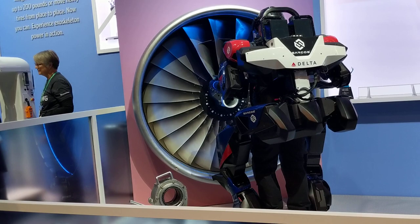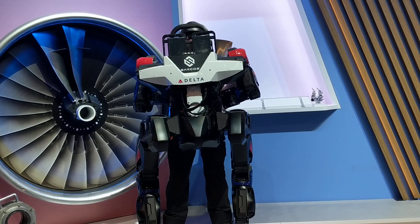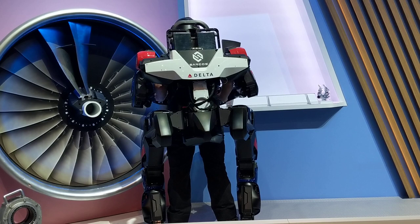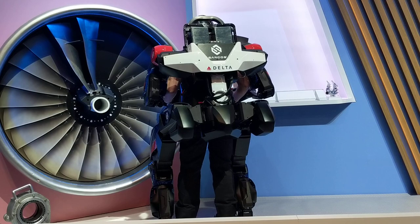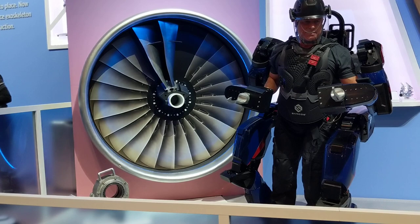Lock my arms again. I've removed the nut. Now I'm going to remove the fan blades. Just step over to my right, put it in the holder. And I'll continue that for as long as necessary to either replace or remove completely all the fan blades in this engine so they can do the diagnostics on them to maintain that regular maintenance cycle. And that's the task.